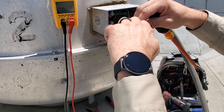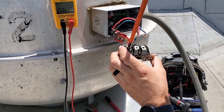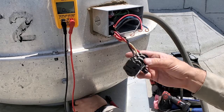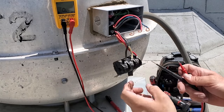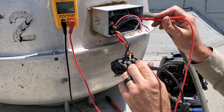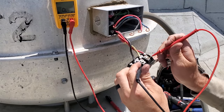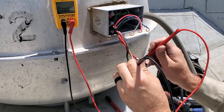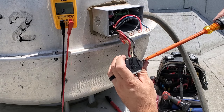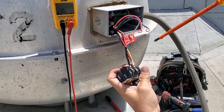Before I go further, I probably should have checked the motor to ground to make sure we didn't ground out the motor — because with the one leg that was completely bad, it was probably single phasing. So before we go any further, I'm going to test the motor windings to ground to see if we have any shorts. No short to ground on any leg. And we should have continuity between the windings — 4 ohms, 4 ohms, 4 ohms. So theoretically, our motor should still be good.